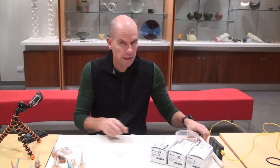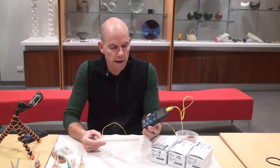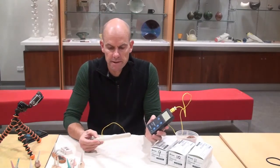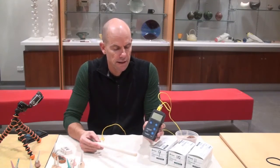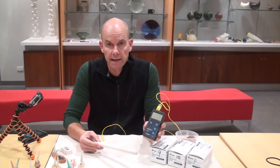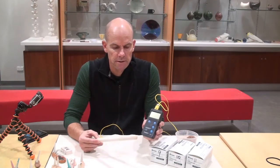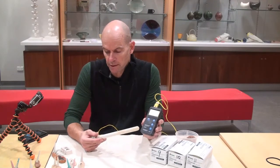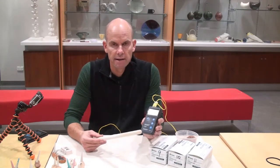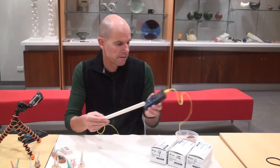Let's talk about measuring the temperature inside your kiln. You've got a couple of options. You can use a thermocouple. These are great. The probe pokes inside the kiln and you have a digital readout that gives you an indication of whether the kiln's going up or down. There are some issues — it's a mechanical device, they do wear out. They're never that accurate unless you spend a fair bit of money on getting a really good one.